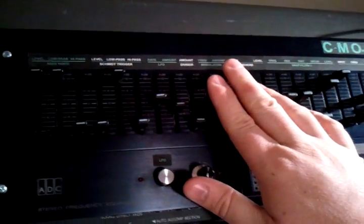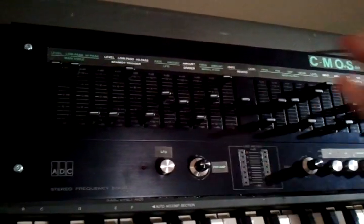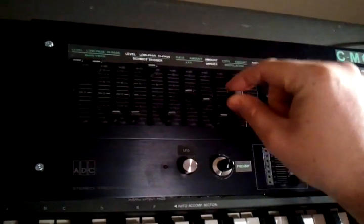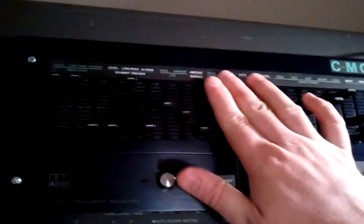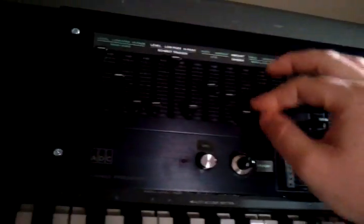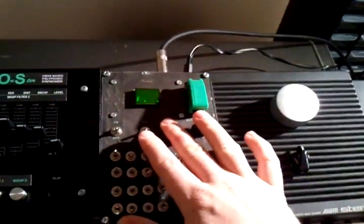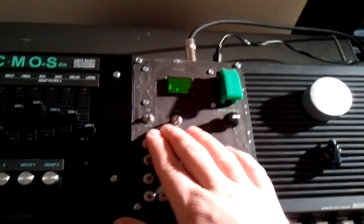Apparently it's not ideal for the chip to be powered off sound sometimes, but I haven't had any troubles yet. And for the cost of a 40106, if something does happen it's cheap to replace. After that, the sound goes into a sequencer. I use a 4029 for my sequencer, decoded with a 4514. It accepts an internal clock and also has an output for an external clock.